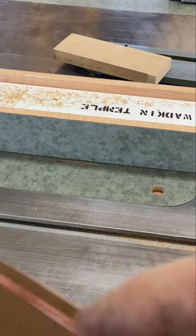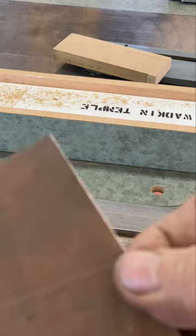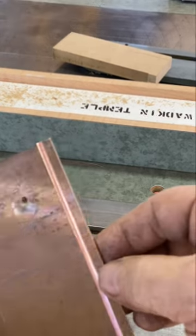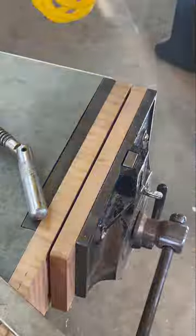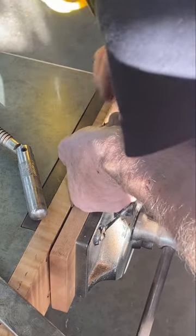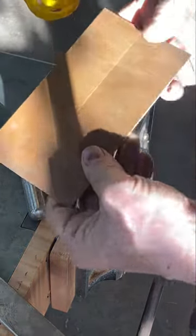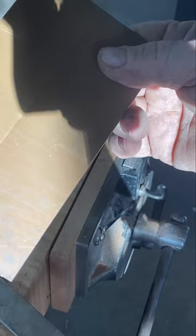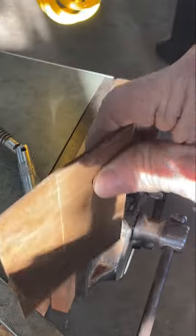They're in a little notch — see that? That'll allow me to bend in a perfect line, to score all of these and then go up on the other side. Now my metal brake is capable of folding this without a score line, except see I just made a little bend — and you see how straight that line is. That is what this heavy gauge benefits from.